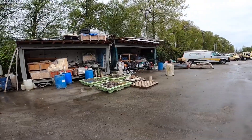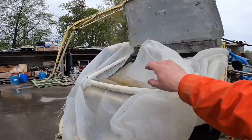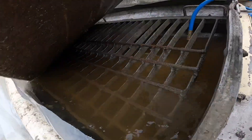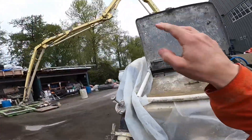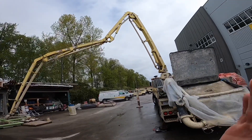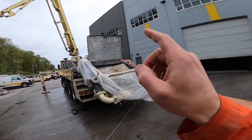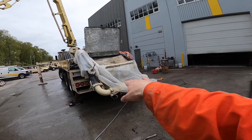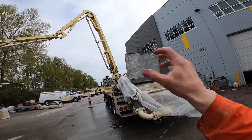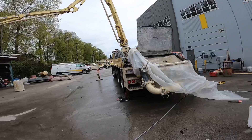We'll use the pump pushing water to push everything out right through the end of the boom into the pens. Got the hopper full of water, full to the top. Nice little A-frame action going here - I wouldn't want to try this in a Z. It's only good with a nice linear path for that sponge to go, as linear as possible. It's probably gonna take a couple strokes, and once that hopper runs all the way down and it's sucking air, I'm probably gonna have to fill it with water again because I'm not gonna be able to push this out with air pressure - it's gonna have to be hydraulic all the way.